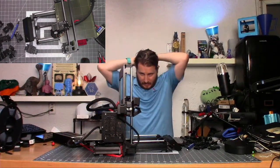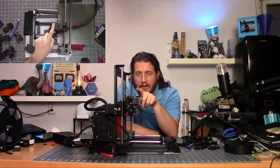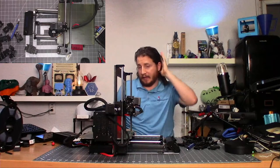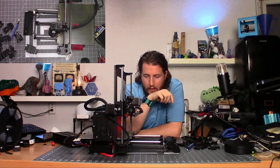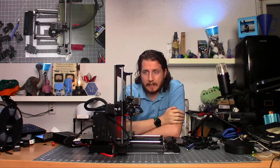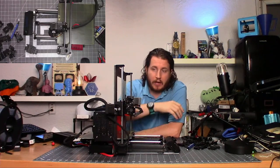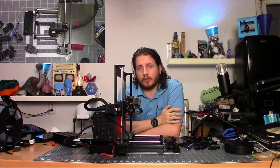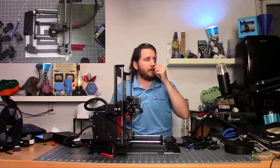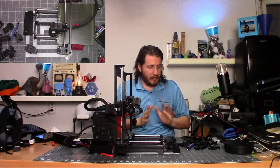We're gonna be fixing this sad Prusa. I'm not certain if it is easy to see, but the entire extruder here is droopy. Like it's at a good 5 to 10 degree angle. This is not one of our printers. This is a printer that belongs to a client. They had it in a chamber, and unfortunately, they put the heater for the chamber blowing right on the extruder, getting the PETG that the extruder is made out of too hot, and therefore getting a little bit soft. So, eh. It happens. We've got some parts.